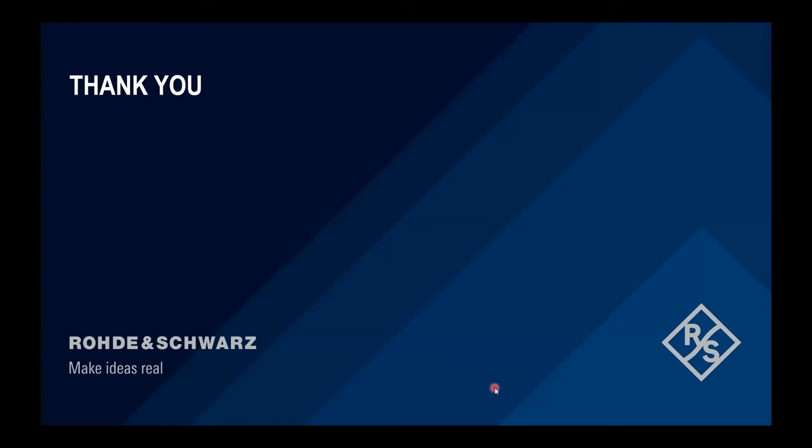Next one was, how many seconds is the appropriate transient time at startup? So basically, there is no real rule of thumb because this all depends on your power up behavior. If you'd like to switch on everything quite fast in your design, you'll need to get a high amount of current from your grid or your supply. If you think about a mains connection, this might not be such a huge issue. But if you think about a battery powered device, the battery will provide you a maximum current.